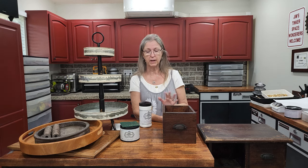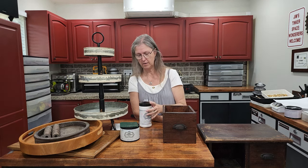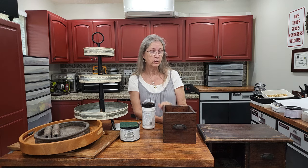Welcome to Angels Nook. Today I want to talk about the prep that's required for the paints that you see me using all the time — the all-in-one paint by Heirloom Traditions. Normally all it's going to take is using the De-Glosser liquid with a green scrubby or the wipes to scrub and wipe down your surface, and then start applying your paint, which makes this paint so super easy to use. I am not paid for this — it's simply because I believe in these products, and if they are used properly, this paint is almost indestructible on any surface when you've prepped properly.